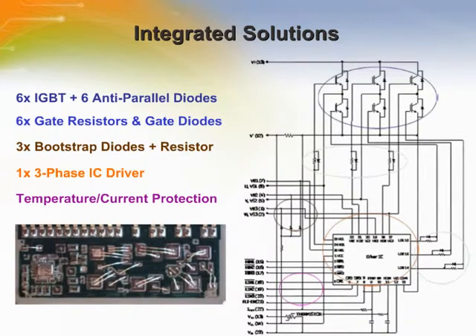The Intelligent Power Module is a complete integrated solution. Replacing more than 20 discrete parts, IR's IPMs in SIP packaging reduce component count and board space whilst improving reliability by delivering a complete power stage for variable speed motors. The IPM contains six IGBT dies, each with its own discrete gate resistor, six commutation diode dies, one three-phase monolithic level-shifting driver chip.